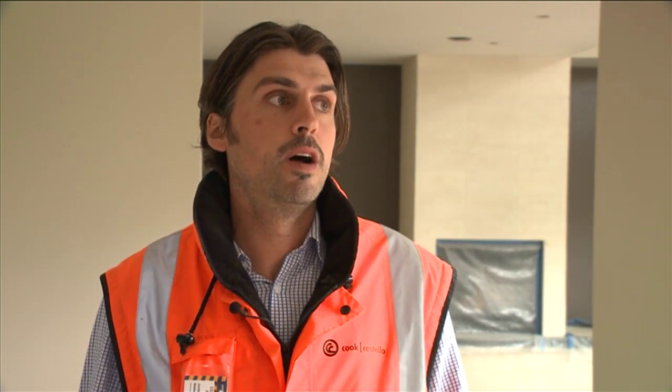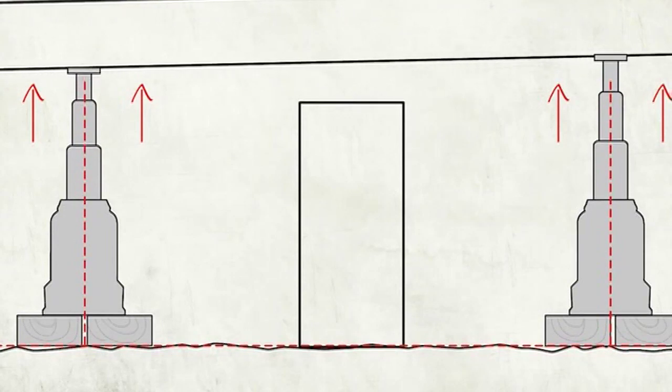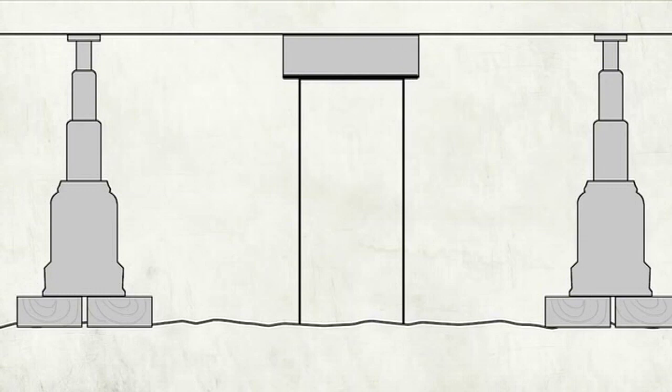What are the different repair methods used for foundations? The repair method is dependent on the foundation type that your structure is supported by. For Type A and B foundations, which are more lightly loaded and have a flexible floor material, we generally use mechanical lifting methods — most popularly known as jack-and-pack. That involves using a mechanical device, a jack or hydraulic lift, to raise the floor to its level position and then providing a connection back between the bearers and the tops of the pile heads or ring foundation. That's the packing part of the jack-and-pack.